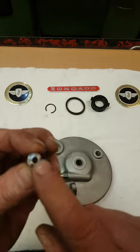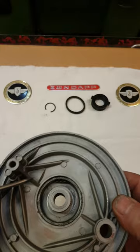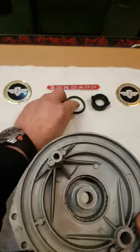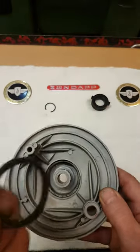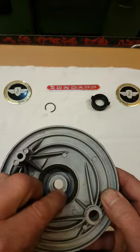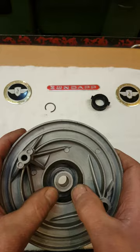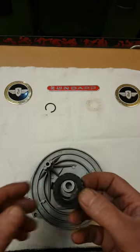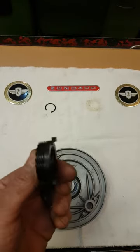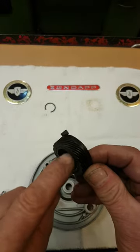So you can solve this by drilling the hole in the threaded piece a little bit bigger. After you're sure the worm runs free, you have to glue the felt ring in the corner — put glue over it, place it nicely in the corner until it's flat, and wait until it's dry.